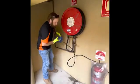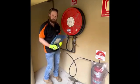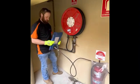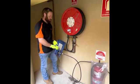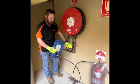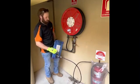I've just connected the bag up to the thread on the front and connected to the CO2 supply — that's the CO2 gas we use for this bag. What I'm going to do now is remove this fire hose reel and fit the new fire hose reel. We're leaving that valve there connected to the supply, then we'll get our freeze underway and change that valve over.